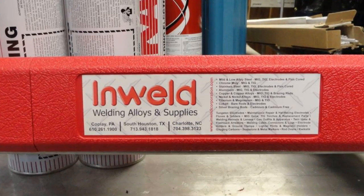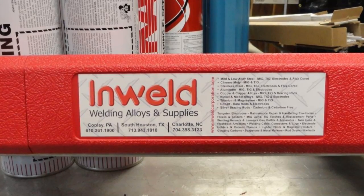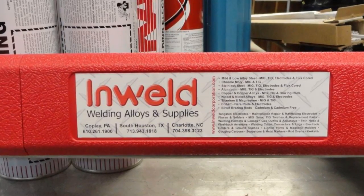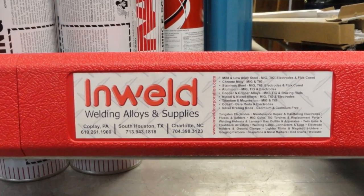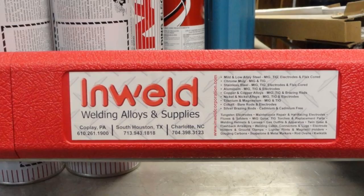Although the results may be fairly crude next to TIG, it is a workable solution in many cases. Welding aluminum with stick is not intended for welding on thin sheets of aluminum, but when welding on 1/8 inch or greater it can provide satisfactory results.